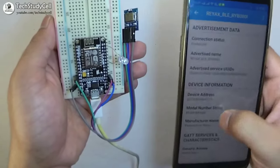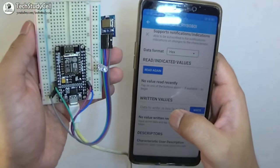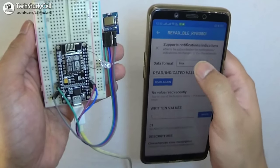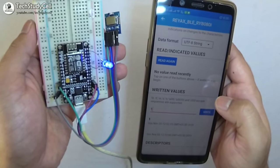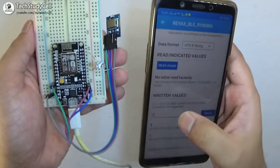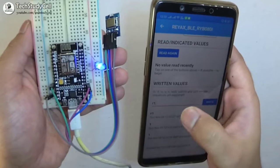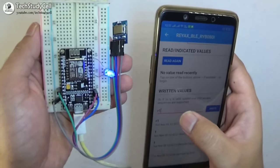Showing it is connected. Let me choose characteristics 1 — in the code you can see if I send '1' or 'r1', the LED will turn on. First I have to choose the string, and now if I send '1' you can see the LED turns on. If I send '1' again, the LED will turn off. Like that, if I send 'r1', the LED will turn on. You can choose any string to turn on and turn off the LED and modify the sketch as per your requirement. I will share the sketch in the description.